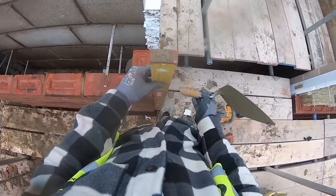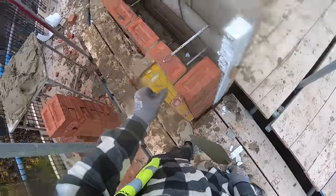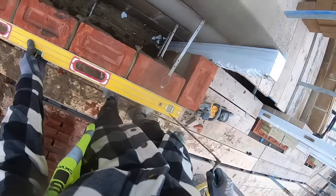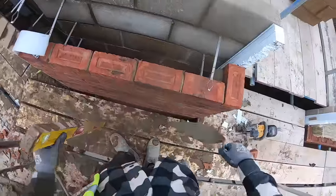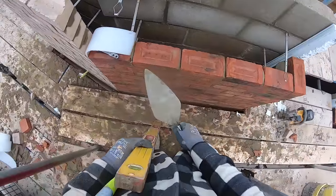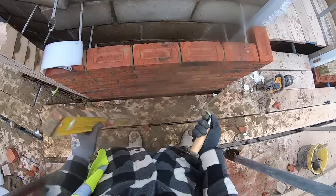Plumb it up and reveal - up this side, and then just stick it through the front. And that's basically it, that's what I'm looking for. You sort of train your eye to see the bed size. I actually find it easier to eye the bed rather than the top of the brick.